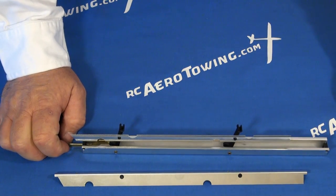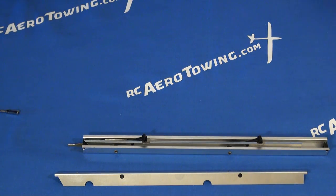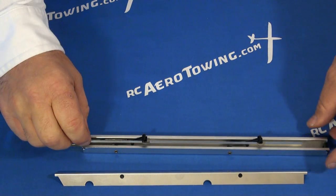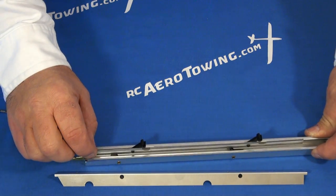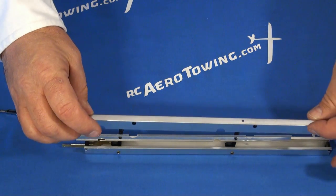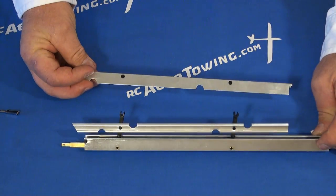Here's where I want to talk about how a spoiler will bind up. Those pins we just placed into the mechanism will loosen up over the season. When they loosen, they allow the blade to slightly come off, and as that happens it starts to catch on things — it can catch on the edge. When you put the top mechanism piece on, you'll see how the two blades will actually bind up on each other. Those are the common causes and errors.